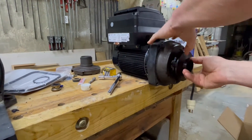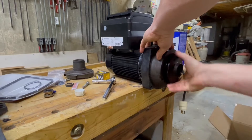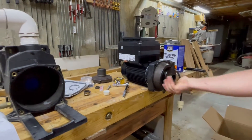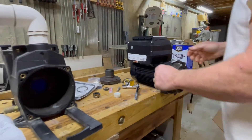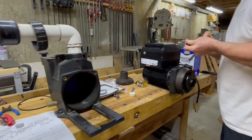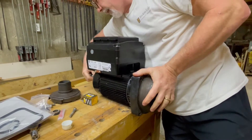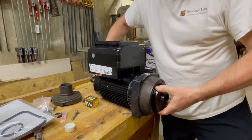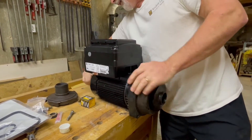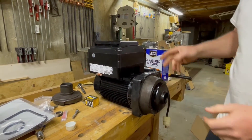Here's where you're going to need the Allen wrench — without it you won't be able to get it tight and the shaft will just spin. You can use one made for a socket or just a standard Allen wrench. The impeller doesn't have to be real tight because the rotation of the motor itself will actually tighten the impeller on there.